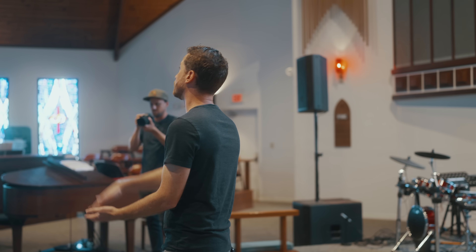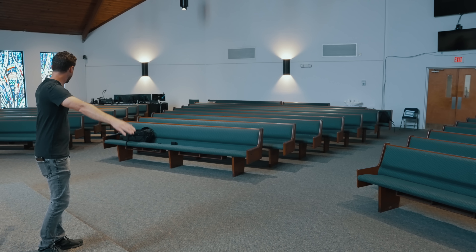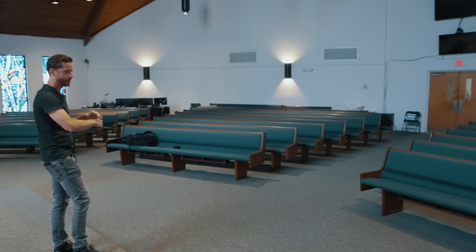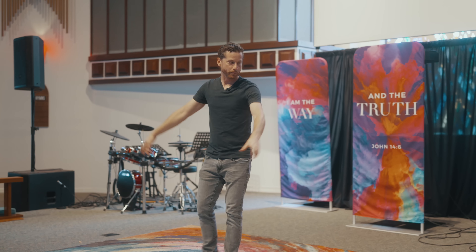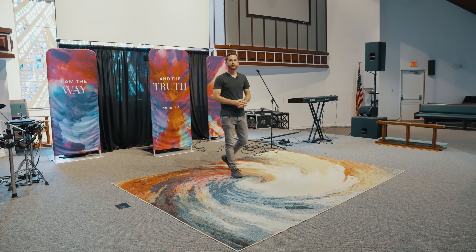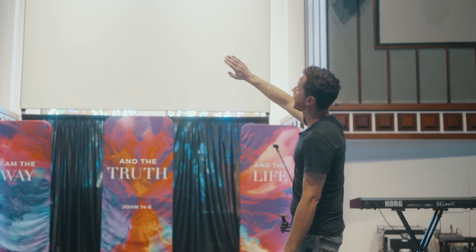For the altar area, because of beam distance and ceiling height, we could get away with two fixtures to light the full width, but I would do three — essentially a left, center, right. For the pulpit position, I'd increase that to four fixtures using a cross-aim technique to eliminate as much shadow as possible: one light hitting this side of the face, another hitting the other side, filling in the gaps. Then four fixtures again for zone three, the back line.